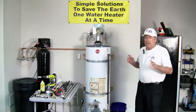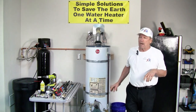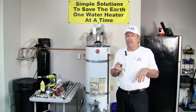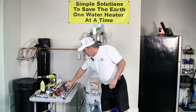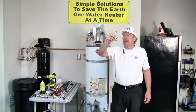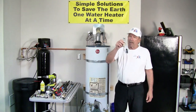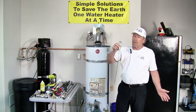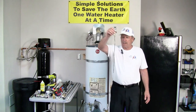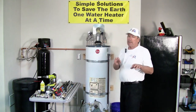If you want a simple trick to know if you need an anode: just take a draw of water off the bottom of your drain valve and that will tell you the rust situation. If you pull rust, you've got a problem with your anode — that anode is most likely fully consumed, which means your tank is now rusting out. Does that mean you should get rid of your tank? Not necessarily. I've worked on many water heaters with lots of rust, dropped an anode in, and some of them lasted 10 years plus. Generally when you drop that anode in, even on a badly consumed rod, it stops any further rusting inside that water heater.